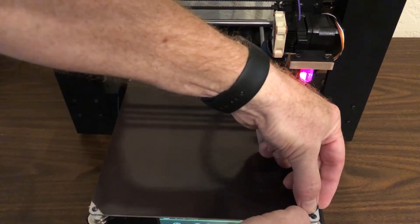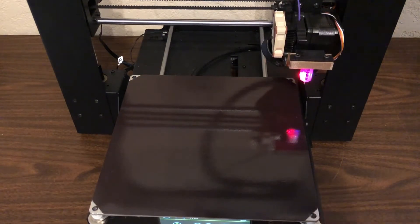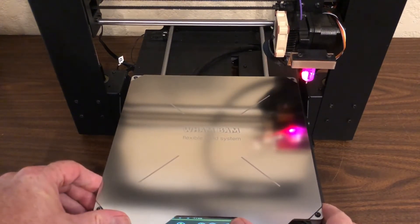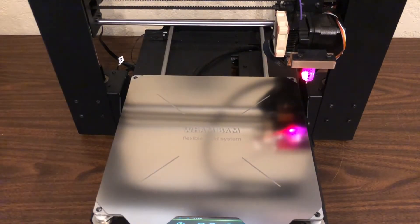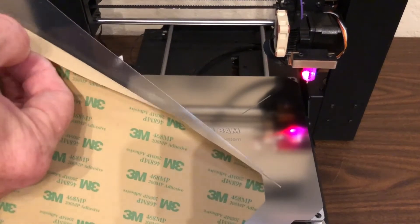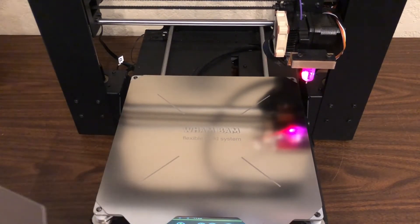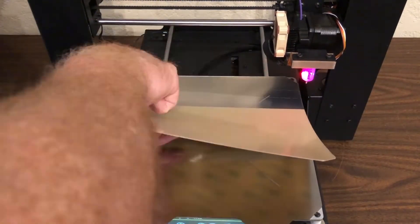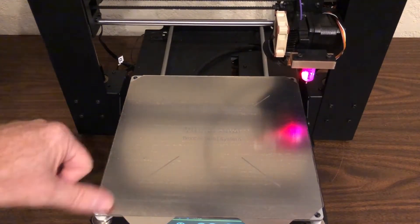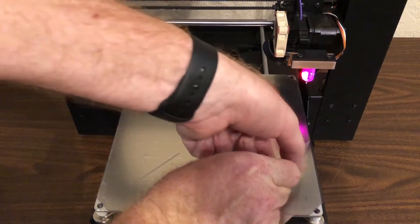Make sure the whole magnetic base is flat. If you're off by a little bit, like I was here with one screw head, you can trim the magnetic base a little bit with a knife so it sits flush. Now we can put the flex plate on the magnetic base — it sticks really well to the base. We're putting the flex plate on so it'll be held still while we put the print surface on. We're only going to expose about an inch of the adhesive at the back, stick it down at the back of the flex plate, and work forward, pressing the print surface down the same way we did with the magnetic base. Press it down a little bit at a time, going back and forth, working forward. And now it's time for one of the most satisfying parts of the entire installation process — removing the protective film from the top of the print surface.